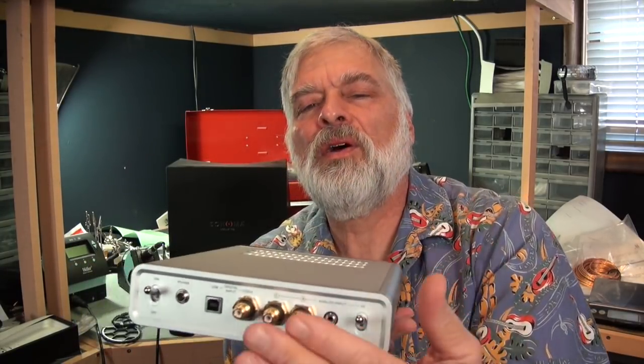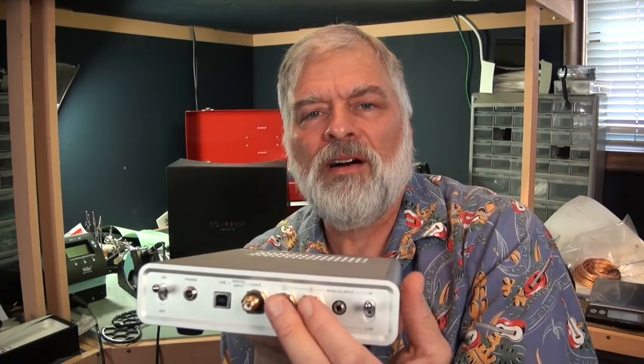And in fact, even when you put in analog signals, they are digitized through an ADC, an analog to digital converter, before being sent off to the digital signal processor in here. As a result, if you overdrive these inputs, you end up overdriving the input of the ADC, and as a consequence, you're sending inappropriate signals to the DSP, and you can run into problems. I had some problems initially as I overdrove these when I made measurements, and I had to contact Sonoma and figure out exactly what conditions I had to have to set this properly.